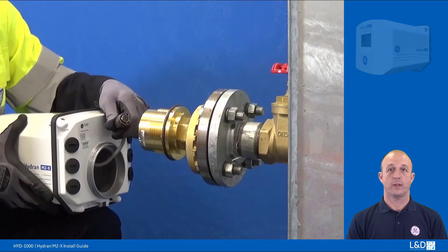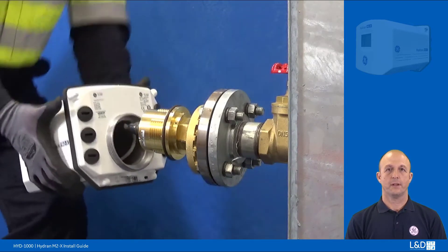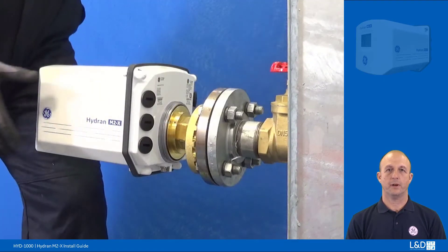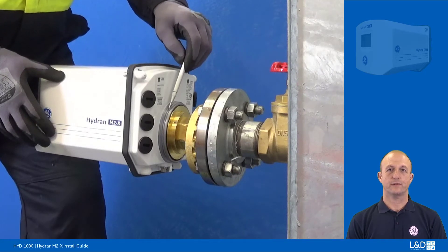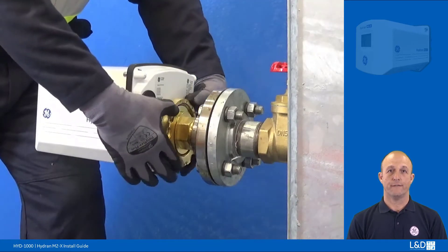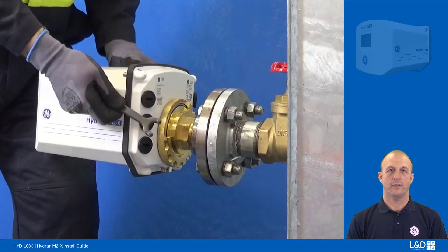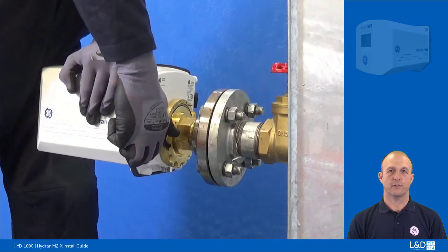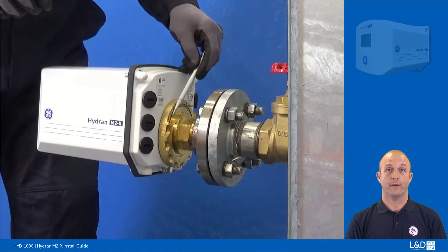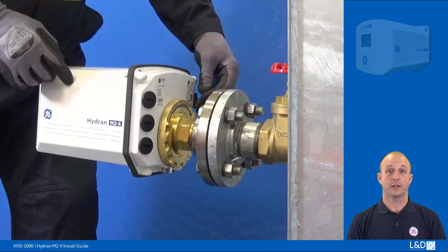Next, refit the unit to the sensor. With the electrical connection in hand, locate the keyway and twist to secure the connection. With the electrical connection secure, bring the unit in over the sensor as shown and guide it over the sensor until the O-ring is completely covered. It is recommended at this time to apply some anti-seize lubricant to the base plate threads to ease future maintenance if required. When locating the Hydran body over the sensor it is most often lined horizontally, making it easier to read the LCD information. Whilst supporting the unit, tighten the sensor securing ring by hand first, then by using the C-spanner on the area of reinforced material. When tightening is complete, ensure the securing ring reduced portion is aligned over the bleed screw and hole to allow for any future manual samples to be taken. After sufficient tightening of the securing ring, tighten the grub screw to prevent the securing ring from loosening during operation.